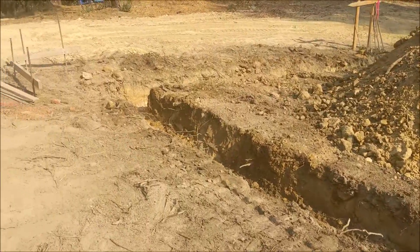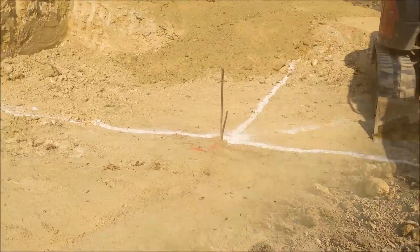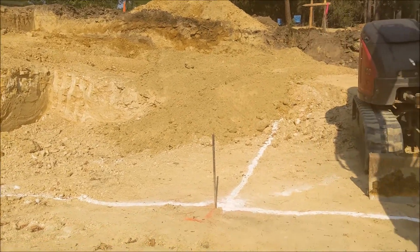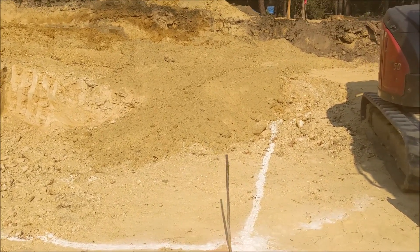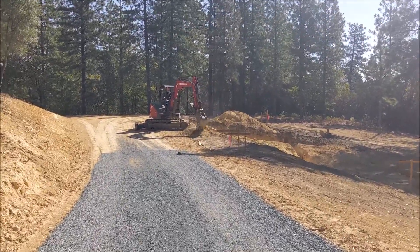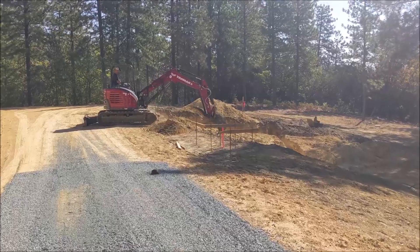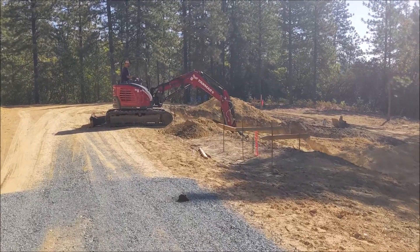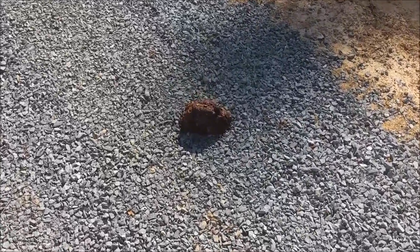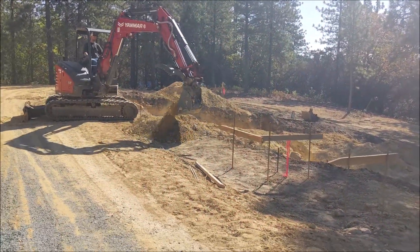It all kind of starts with layout. That takes those batter boards and metal stakes to lay the corners, chalk on the ground to show where the building's going to go, double-checking that everything's square using the Pythagorean theorem, and then starting to dig the footings. You can see right up here a black bear came into the zone last night and left us a little deposit — probably just getting ready for me to move in. So that's kind of cool to see the wildlife visiting.